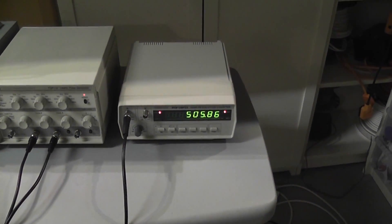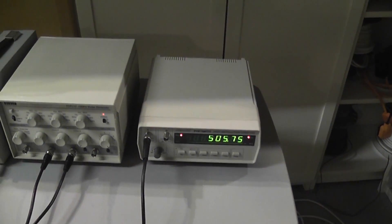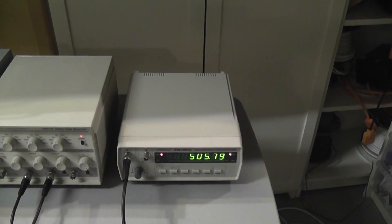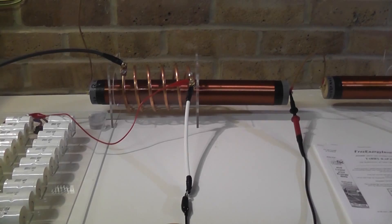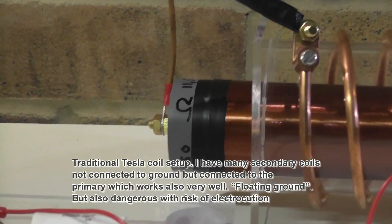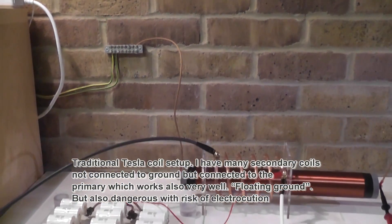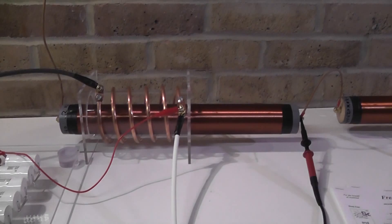At the moment it is about 500 kHz. That is the one I did not calculate exactly — the calculation was between 460 — but with my capacitor it is around 500 and that works quite well. On the driver side, connecting to ground is important — because without it, it does not get into sync.